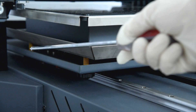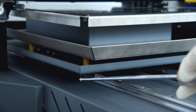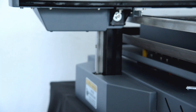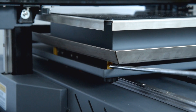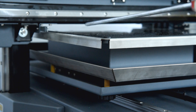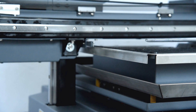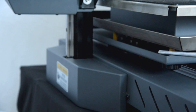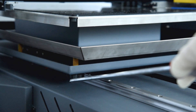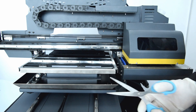There are six screws stored at the bottom of the T-shirt pallet — three on the left and three on the right side. These six screws are used to adjust the pallet vertically and horizontally to make sure the distance between the printhead and T-shirt surface is the same at every angle and position. If you find the table is not flat or not level, you can adjust these screws slightly to make it flat at each position.